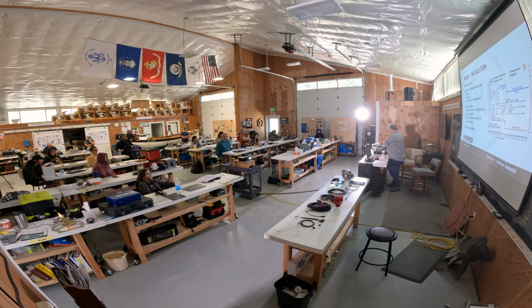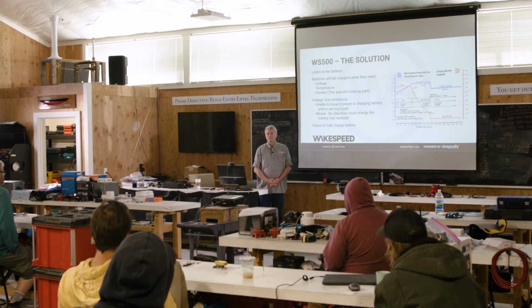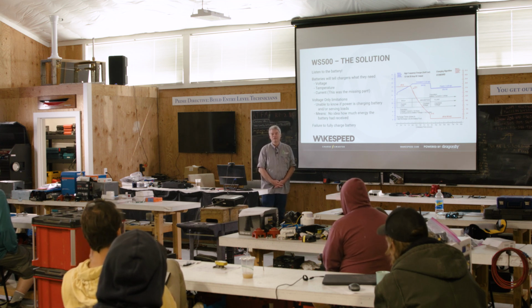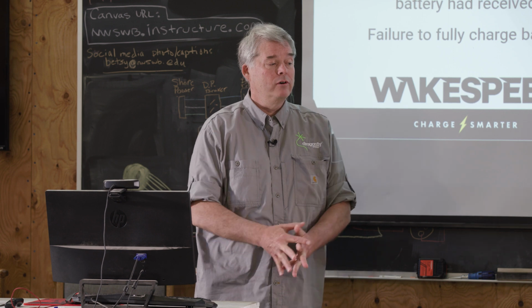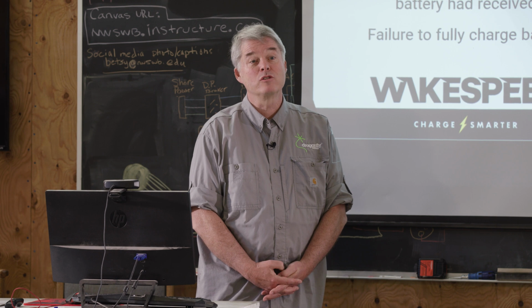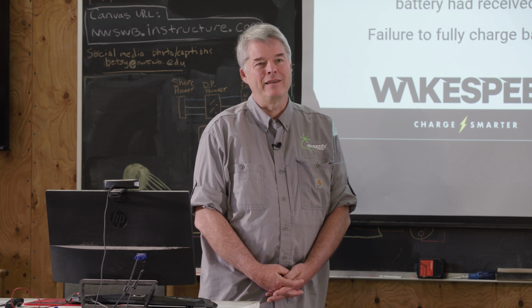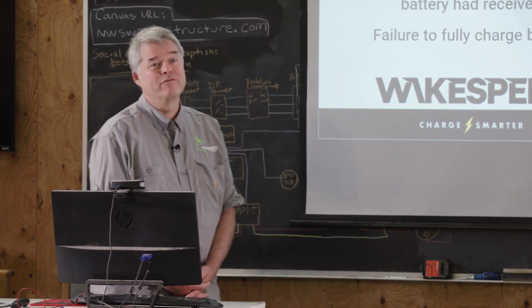Sorry, one more question. That's these guys up here, right? Yes, sir. Are they usually encrypted, or can you just reverse engineer them? Yeah, you can sniff them. Absolutely, if you want to. I was thinking if you have a Raspberry Pi or something else, you can just pump it through. You know, just issue a command $ESM:1 to the Wakespeed, and it turns it into a really expensive CAN sniffer. It'd be like hooking up your Raspberry Pi with a CAN hat and issuing the Linux command candump. So yeah, you can sniff it if you want to.